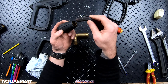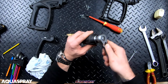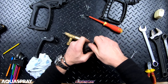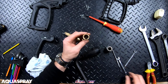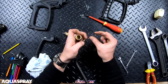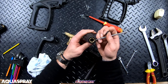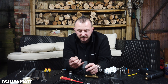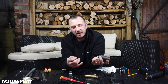The only other thing that's serviceable on this is this bit. It has a 14mm Allen key, and at the back end there it does have a socket for a 22mm. If it's leaking from where the connection to the lance is, you can unscrew this bit and there will be an O-ring in here — a heavy O-ring. This one looks really nice. There's nothing else in here. If any of the ball bearings are missing or broken, just get the whole thing — it's not worth messing around. You can't buy the ball bearings unless you go to a specialist bearing place, and then it'll probably cost you even more money, so just buy the whole kit — you can buy one of these for about 25 quid.